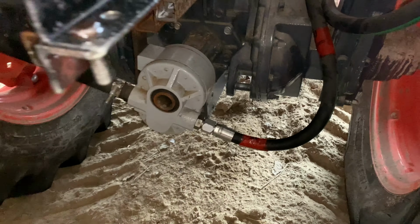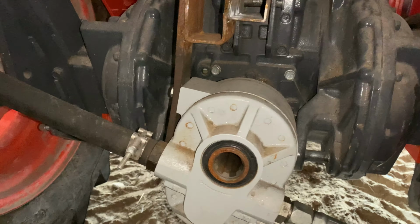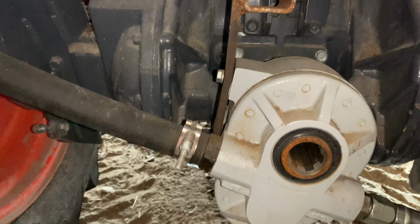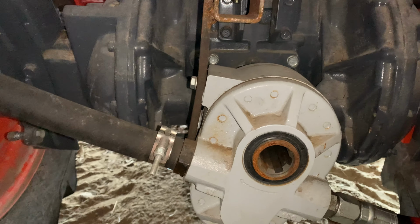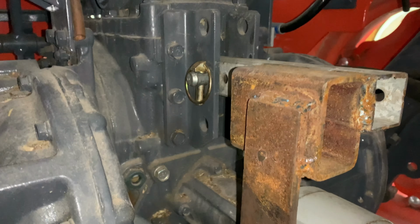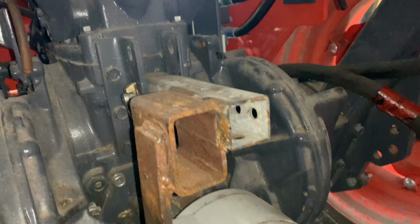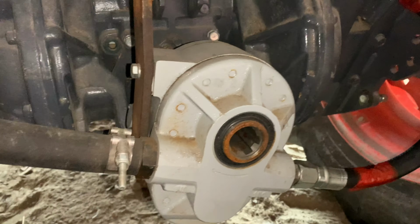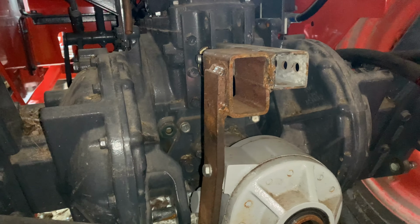It's a little bit dark back here, so I have the flashlight on. Okay, so he's got, and you can see that he's bent it, so it might not be heavy enough. It looks like 3/8 flat bar. It's about 2 inches thick, and it's mounted to where the three-point hitch gets connected. There's no pin on the pump. It just kind of sits on there, and what's holding it is the bracket here now.